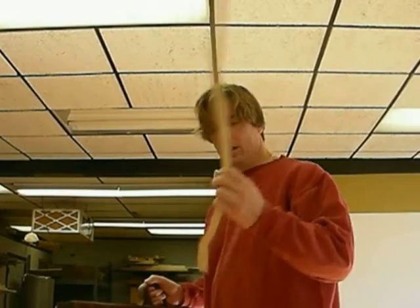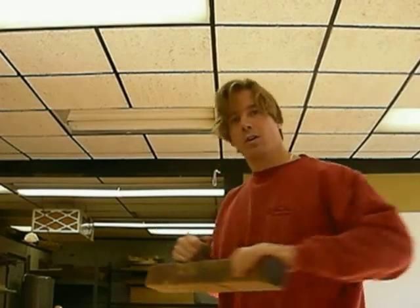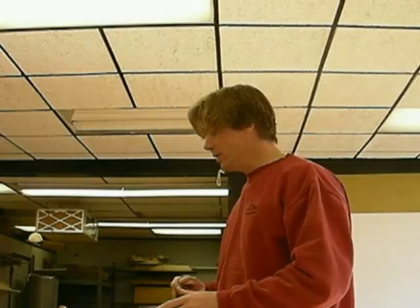I ended up just having an old wooden plane around my shop, and Steve and I got to thinking and talking. We decided that it would probably be best if I could retrofit a plane to this curve, and then it would be easy to plane the inside of it and keep it flat. Otherwise, it would be really difficult to take two lines on either side of the board and remove that material and keep it flat over two feet without having a plane.